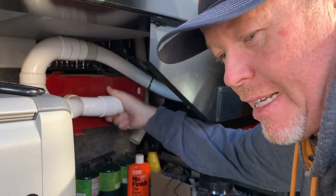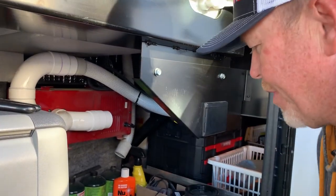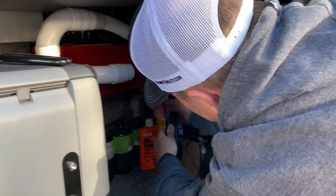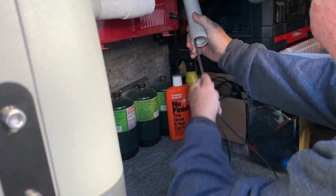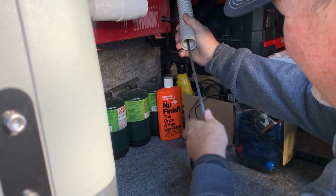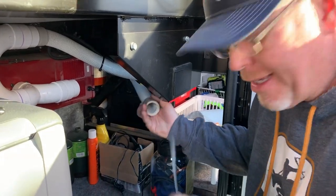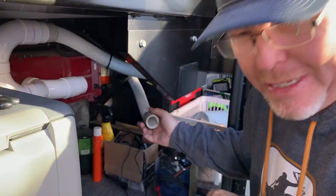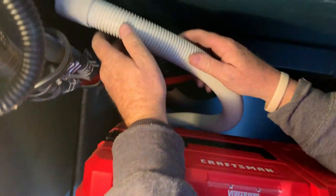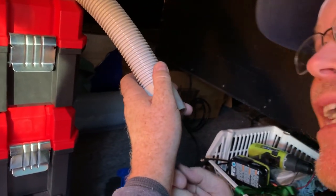There's PVC pipe with purple glue, so this isn't coming off. I was able to get this off and it goes right back in pretty easily. We went and got the snake from Husky and pushed it up there to try to clear the clog. I feel like I'm up against something — it feels soft, so I think it's definitely lined up. We disconnected this from here and put it up pretty far, but it was hitting. As I traced through, I noticed all kinds of twists and turns, so I pulled it through the drop frame to get a straight line and got much further this time.